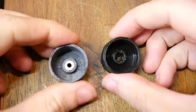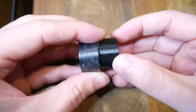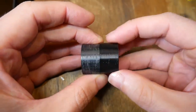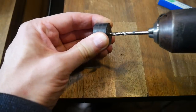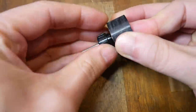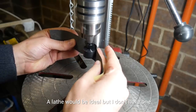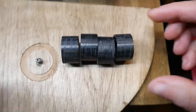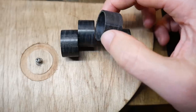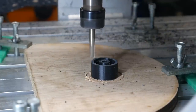Our final comparison is surface quality, which does affect performance. On the inside, the left-hand wheel has cool machining marks, but the important part is the wheel surface. On the machined wheel there are definitely pits and marks that detract from the appearance, but it is actually smoother and more uniform than the printed version. I did experiment by drilling out the spoilboard mounting hole so that when we insert a long bolt it's centred by the bearing, which should be concentric with the outer surface of the wheel. That means rotation should be true, and therefore we have the capacity to wet sand and polish the exterior to a nicer surface finish. However, three of these have been sanded and one not, and after my efforts there really wasn't much difference. I felt my machining chip size was in the ballpark, but further experimentation with feeds and speeds would probably net a better surface finish.